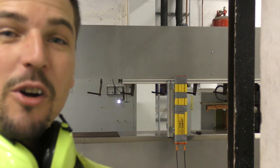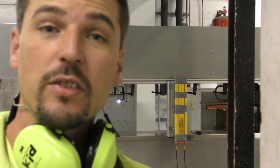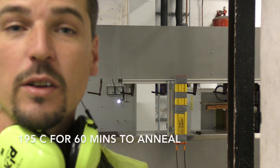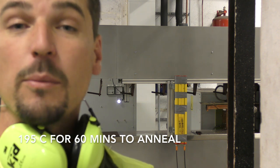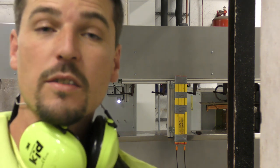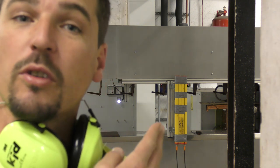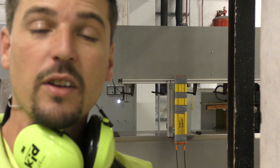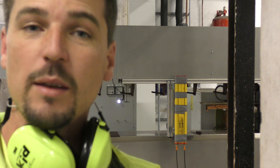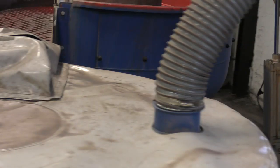So then once the grinding and the hardening happen there, the steel is annealed to take away some of the stresses of the forging and hardening process. In this case with Gransfors, they heat the steel to 195 degrees Celsius for 60 minutes to anneal it, which tempers it. The hardness of the finished steel depends greatly on the carbon content of the steel, but also on the temperature of the annealing process. Once all that's done, they tumble the axe heads with ceramic balls to take away any burrs before it goes to its final sharpening to make the finished product ready to be handled.